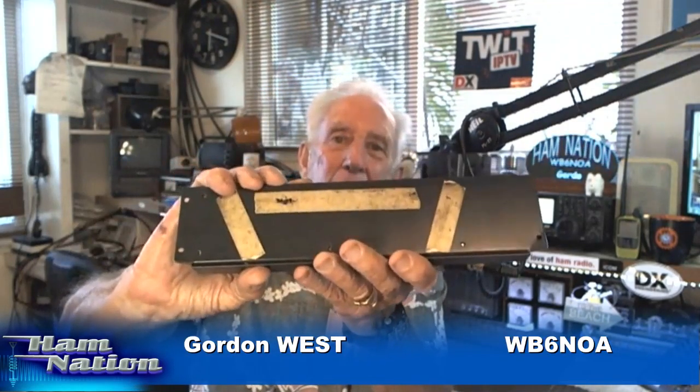And again, I've done a ton of repairs on Anderson connector boxes, but the only ones I've never worked on is West Mountain Radio. They seem to have everything so well anchored that we have yet to break one. And it's not just one manufacturer. It's anything where they go into the circuit board and you're constantly pulling up on it, it's ultimately going to break off the board. But all you've got to do is undo the screws, get to the back, and you should be able to easily resolder the pins that have been pulled out from the circuit board.